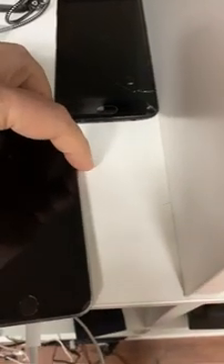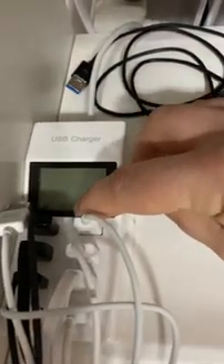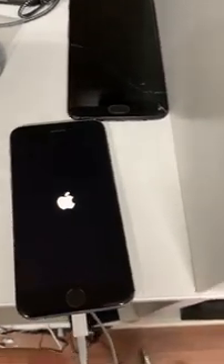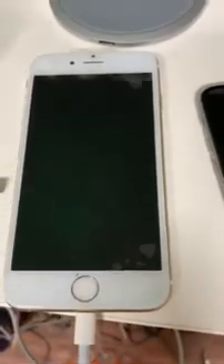You can see the screen lights up, it shows it's charging, and it's turning on. Sometimes it shows the battery charge on screen as empty. The main thing is that the link here shows the battery is charging, which I know is completely depleted at the moment — that's why it won't come on, it will just boot non-stop. So if I plug into the other one — same symptoms, draining battery really quick — there is nothing on the screen. It lights up but it's shorted out, so it lights up and goes off straight away.